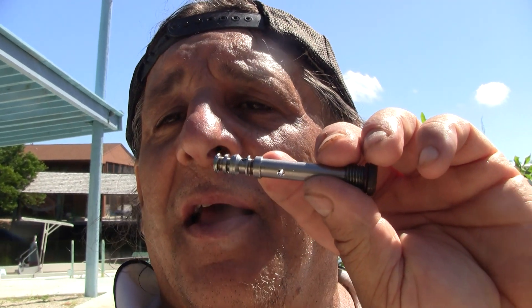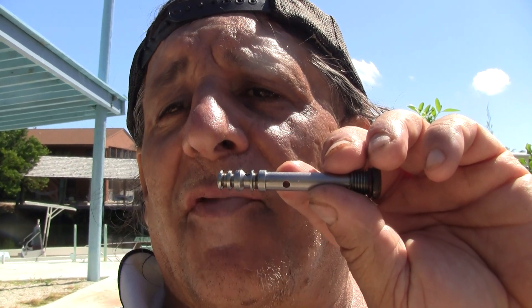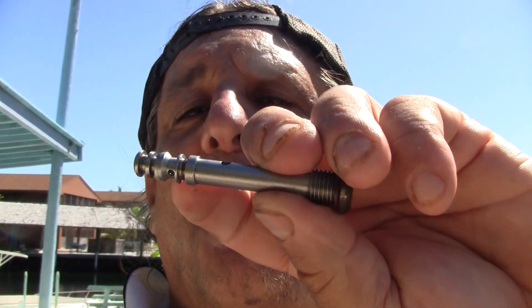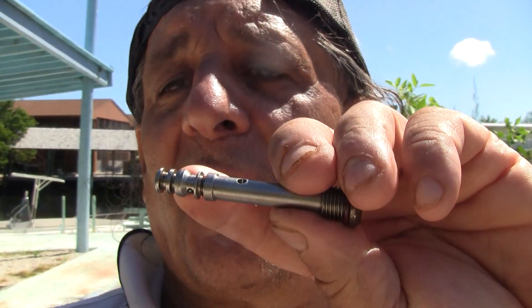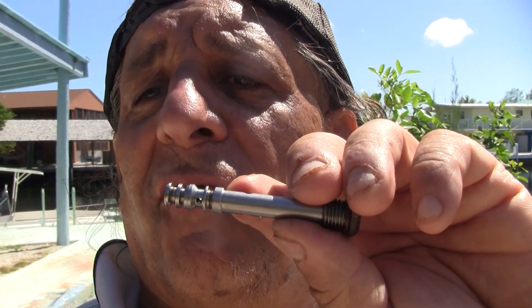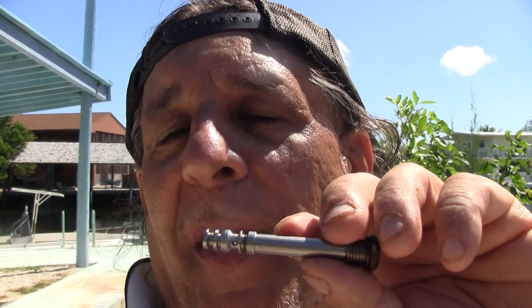Before I say that — if you have a machine with a lever that is not actuating and you have to push the lever in two directions or push two levers to make the system function properly, the reason is that one of these two O-rings on either seat is either ripped or missing altogether. Two systems need to be pushing fluid to excite the motor. It's a pressure thing. But today's dissertation is how to move the O-rings.